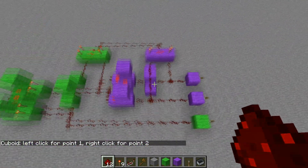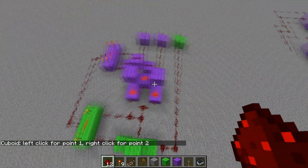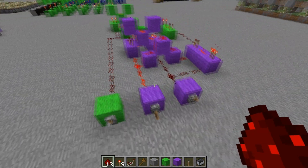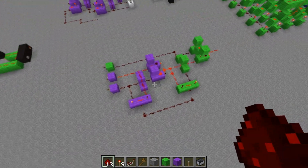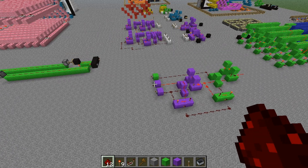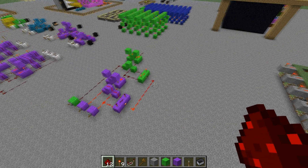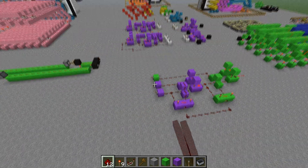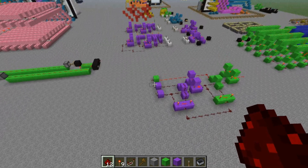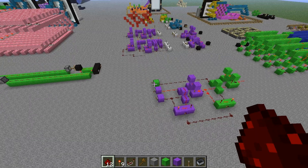You can see the difference between a half adder and a full adder — it's nearly the same thing. We're just adding a few more components to give it that input from the carryover. So you can see it works exactly the same. I'm just going to fly over and show you the inputs here. You can see that it's on right now — off, on, off — and then you turn them both on: it turns off and our carryover activates. So that's exactly how the last one worked. The carry input works basically the same way — if you pretended that block wasn't here, it works nearly the same way, which is good.